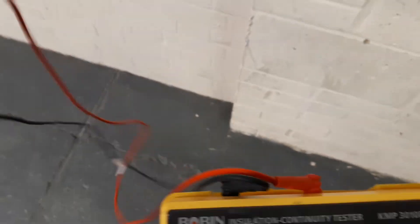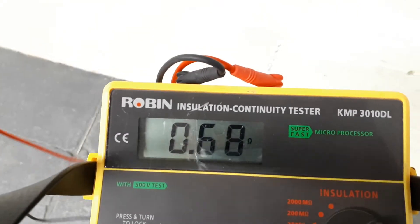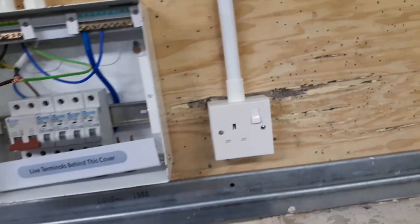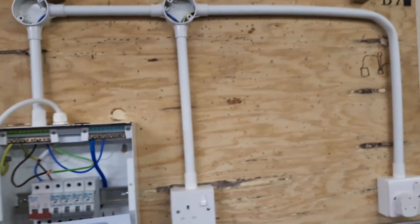When I made the two test leads together at the start, the baseline reading was 0.67. Here the highest reading I got is 0.72. So 0.72 minus 0.67 equals 0.05. My continuity result is 0.05 ohms.